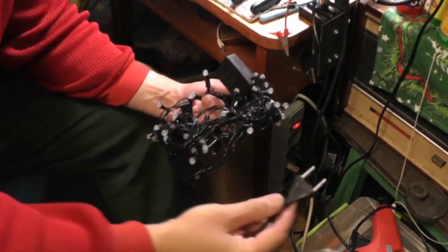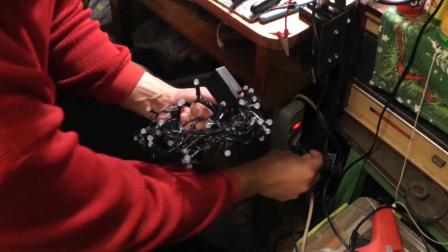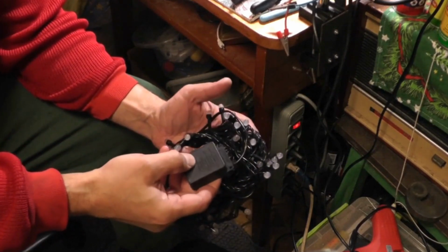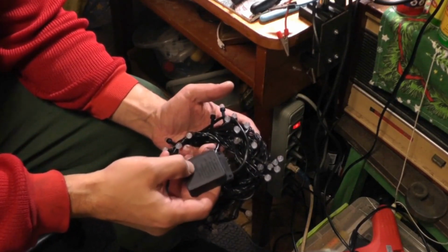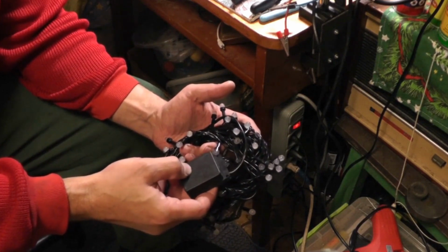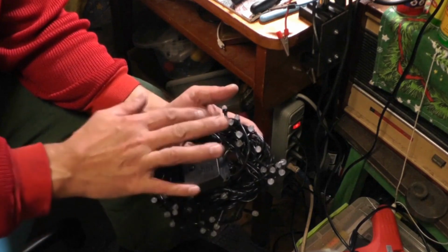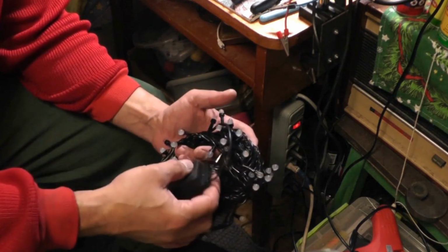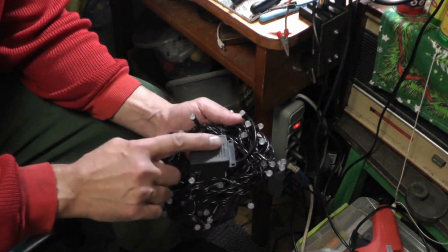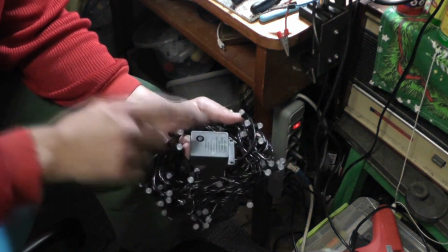Now we will check it, connect it to the power supply, 220 volts, and test it. When the button is pressed, various different modes, such as the ones expected, should light up, but unfortunately, nothing turns on at all. Usually a separate bridge may not work, but here none of them are working. This means we need to look for the specific problem in the power supply to this board, or its components.